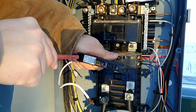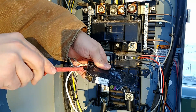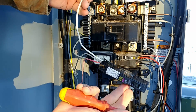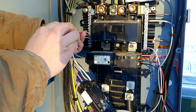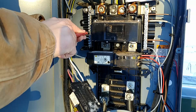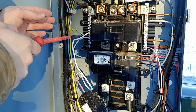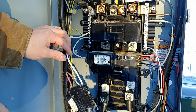Get these good and snug. There is a torque screwdriver that you can use so that you can get these screws set to the correct tension every time — I'll link one in the description if you are interested. Then we have our neutral wire coming from the dual function breaker, and this is now going to land underneath that screw on the neutral bus. You're only supposed to have one neutral per slot in your neutral bus. If your neutrals and grounds are together — as they are here since this is the first point of service after the meter — they are not separated as they would be in a subpanel. If you have ground wires, sometimes you can put multiple ground wires underneath one screw.